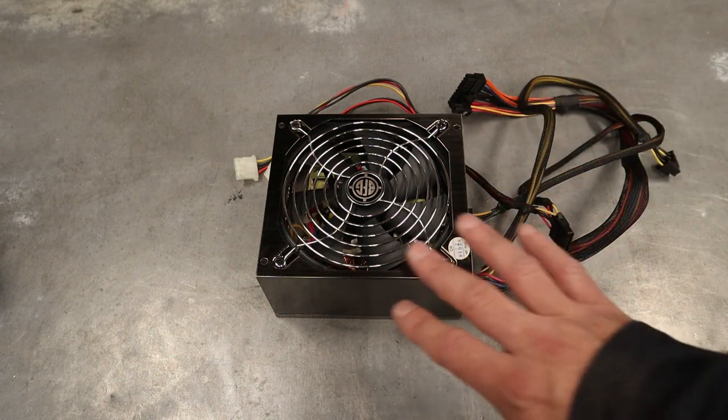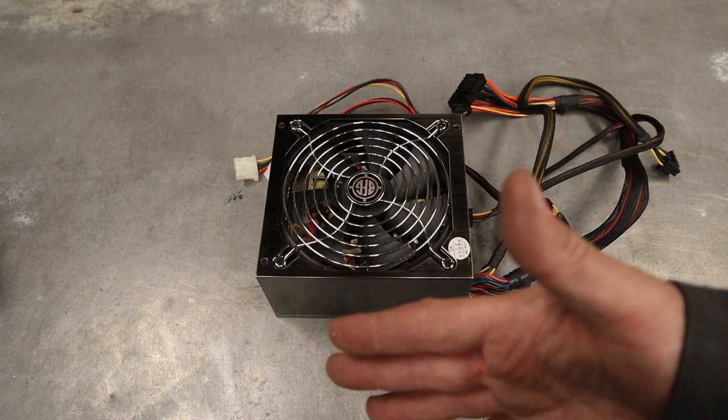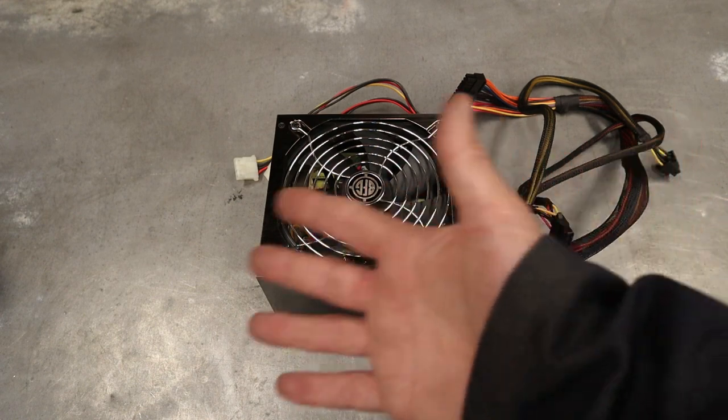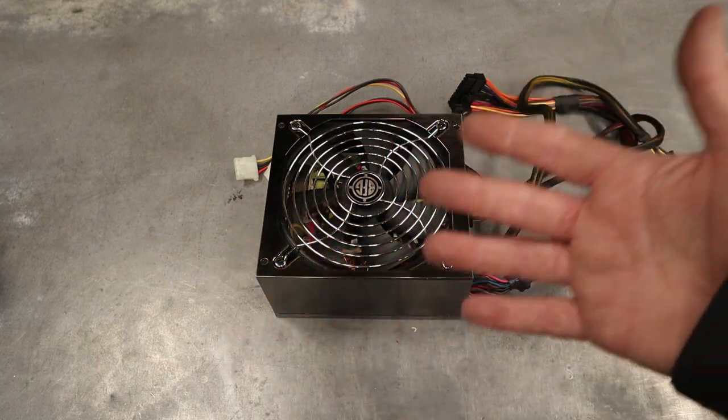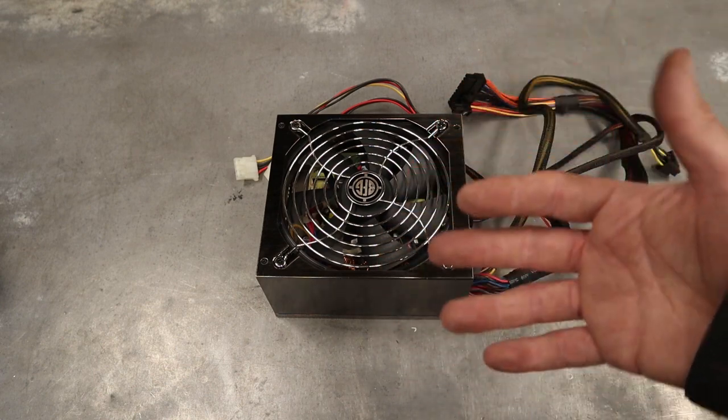And the other one is if we use a secondary power supply, then we don't have to worry about any kind of power fluctuations from driving any 12 volt toys that are going to interrupt the power supply going to our computer. And if we're driving any audio equipment that has been amplified, we don't see those power fluctuations in there as well.